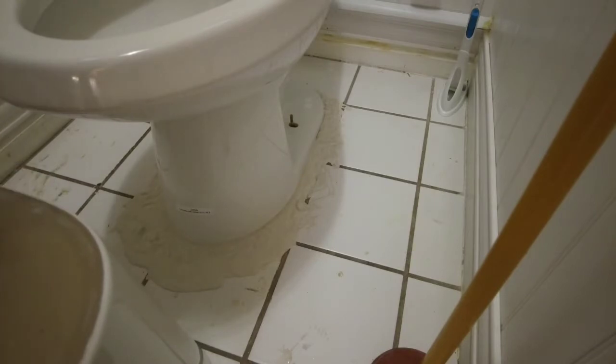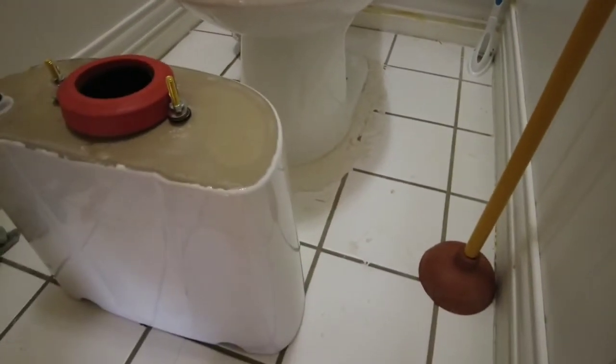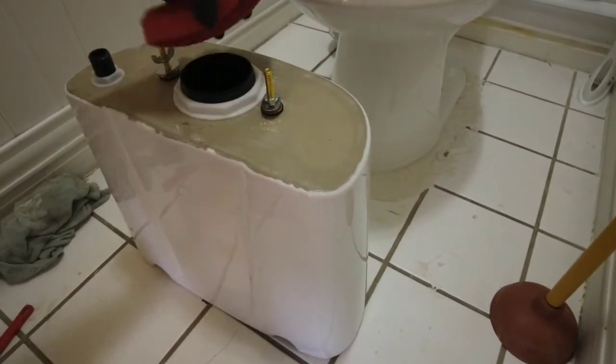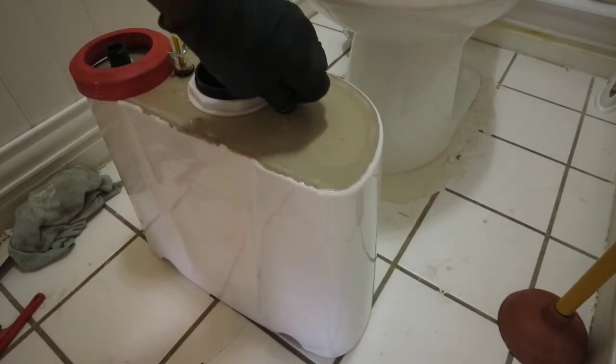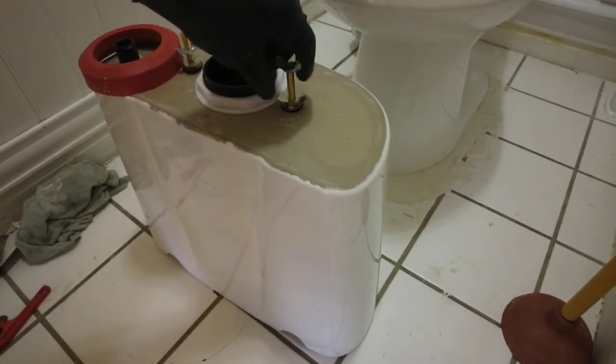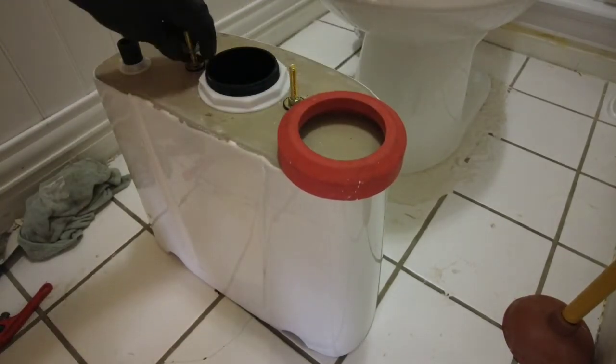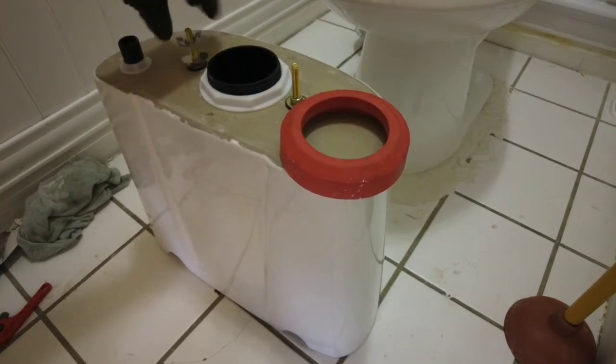Another thing I want to show you quickly before I change that bowl again. Change my pot that's catching the water. Okay, I can actually pour water down here now, since it's sitting there. I want to show you quickly that when the tank comes here, you've got to put the gasket there. But the last wing nut and washer has to come off. That doesn't stay underneath the tank. That's going to lock the tank down to the bowl.